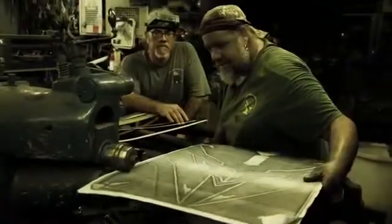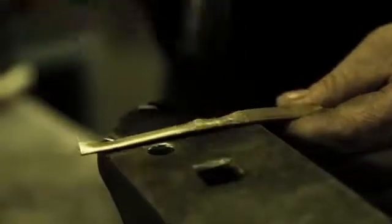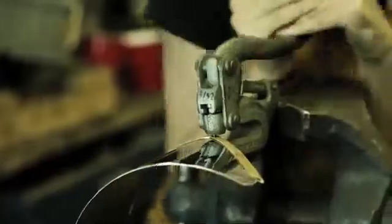We're making the armor predominantly out of steel. It's cold-rolled steel, with a nice polished finish and an electrochemically etched decorative border. A lot of the pieces of armor have embossing and fluting going on, and most of it is covered with a rolled edge of brass, just to give it a decorative two-tone effect.